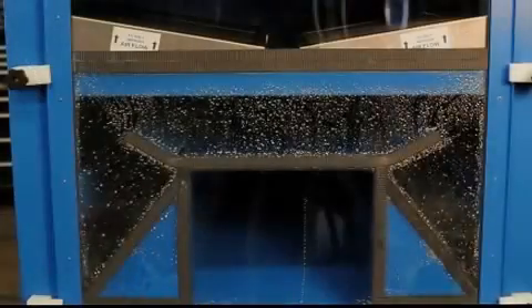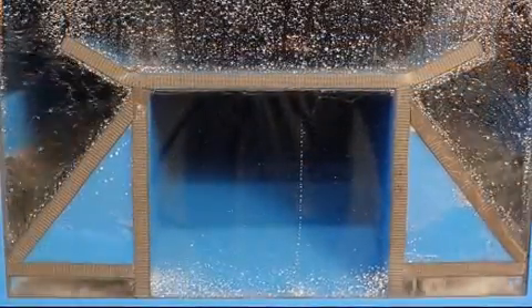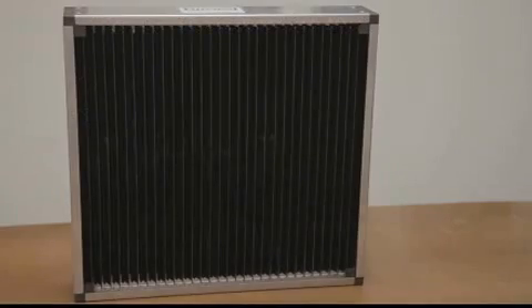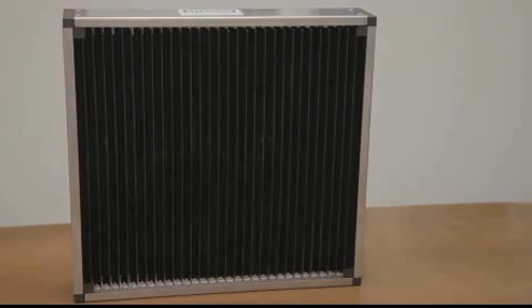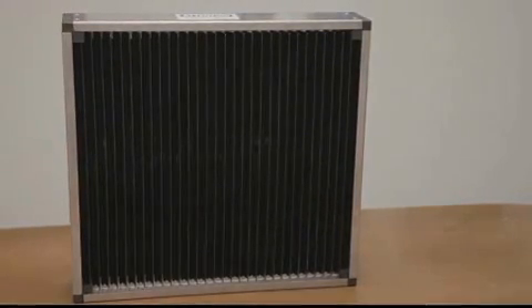The new design allows the impingers to come apart, enabling the use of high-pressure water to reach all surfaces on the chevron, whisking away all the dirt particulate. When the impingers are maintained on a monthly basis, they will stay particulate-free and be a permanent part of your wet collector system. The new impingers will be used in the entire hydroton line and is just another one of the continual improvements the engineers at Filter One continue to make on our entire product line.